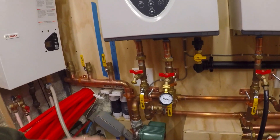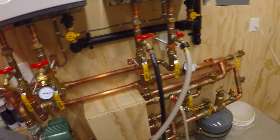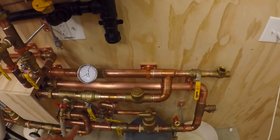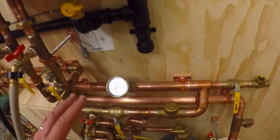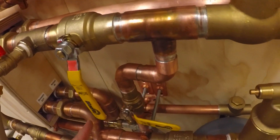Everything is soldered over here, so I'll be able to bring my supply up here, turn, and go out to my supply manifold for my radiant. I'm very close on that — that'll probably be this week, if not then next weekend. I wanted to get this opened up so I could test it, and I soldered this in and got it to a valve, got it where I wanted it.